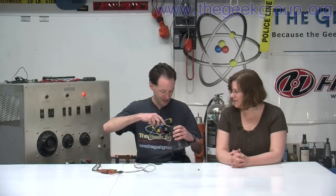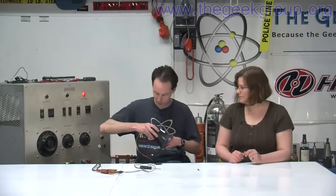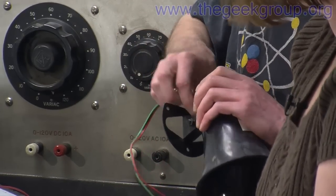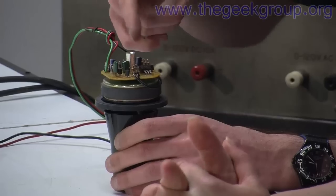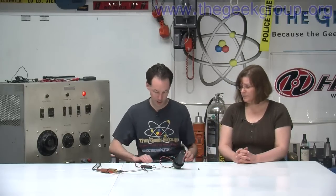What this is, is all electronic — it's all solid state and it's wedged in there pretty good. These are pretty boring just as a thing because it's just a little oscillator circuit and a very basic electronics package, an amplifier, and a little power supply probably in there. A little knock-down voltage regulator. It's all caulked like crazy so this can be kind of tricky to do — they probably don't intend for you to take them apart. So we'll take the guts right out of it. It's a couple oscillator circuits, really simple stuff, a voltage regulator, and then there's a compression driver. If you hook it up now it won't be nearly as loud as it was — it'll still be obnoxious, but we do obnoxious well.